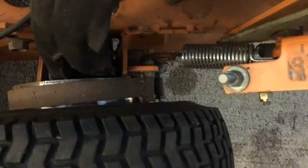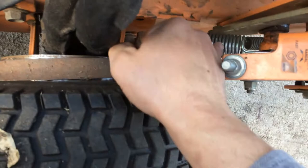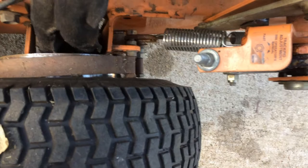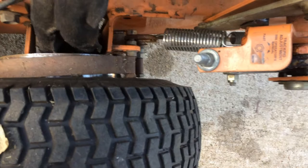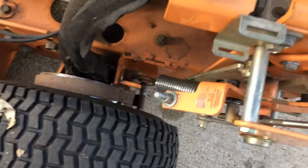I went ahead and got a chain link, cut it, and put it down there — it's a lot easier to compress. It's kind of rigged up here, but I actually grind this spring here. It'll rust more, but I got two on order exactly like my 48-inch Scag. That smaller gauge is not so hard to compress. I grind the spring away, take away some metal to make it easier to compress. But the biggest thing is I use that chain link to make it not so hard to compress.